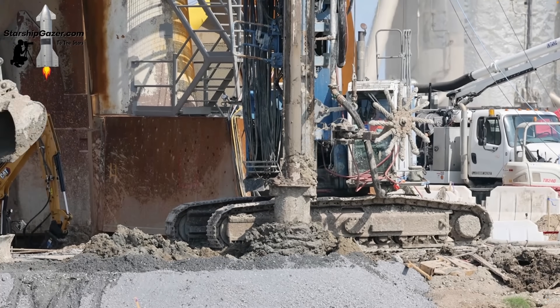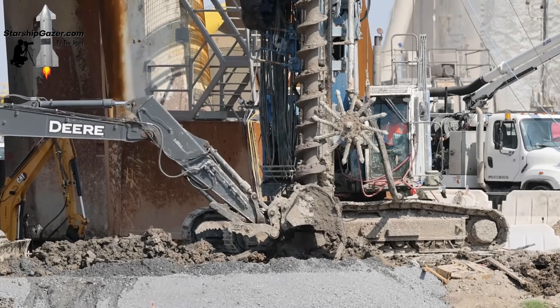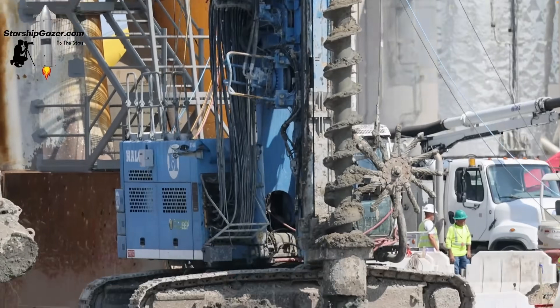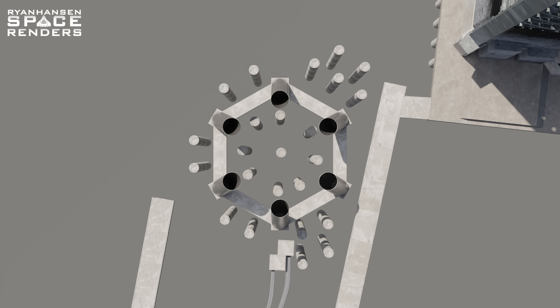Returning to the orbital launch mount, let's quickly discuss the second type of piling used here, which is known as a continuous flight auger piling, or CFA pile for short. CFA piles use an auger similar to what is used in the RBP pilings, except there is a hollow tube in the center of the drill bit. This allows concrete or grout to be pumped through the center. The hole is drilled all the way to the desired depth, and then the concrete is pumped into the hole as the auger is withdrawn. From here, the reinforcement cage is quickly lowered into the pile while the concrete remains fluid. From what we have been able to locate so far, there are 11 of these CFA piles scattered around the launch pad area. These are much smaller than the RBP piles and are around 18 inches or half a meter in diameter.